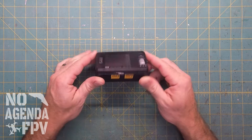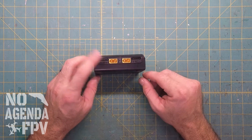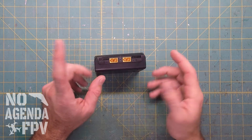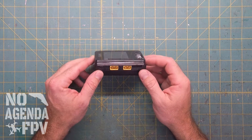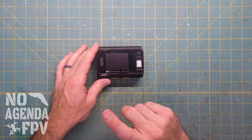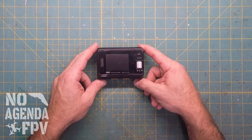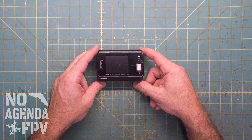I can field charge from battery, but I now have two ports, so I can charge 3S and 4S, 4S and 6S, 4S and 4S, LiPo, Li-Ion. It's nice to have options beyond just charging one type of battery at a time. This is a 500 watt charger, whereas the Q6 Plus was only 300 watts, so I can get a little more current through this one to charge a few more packs in parallel if I need to.